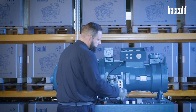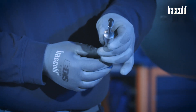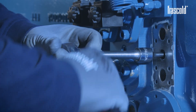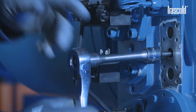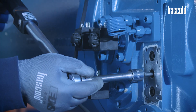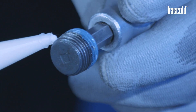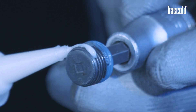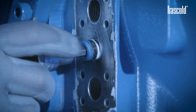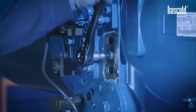Proceed with the installation of the flow switch. First, take the grub screw to interrupt the oil flow and screw it into the central hole using a 6 mm Allen wrench. With a torque wrench, check that the tightening torque is between 15 and 20 Nm. Then take the closing cap, apply some Teflon paste on the first threads of the fitting, and screw it into the grub screw using a ratchet with a 5/16 socket.